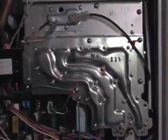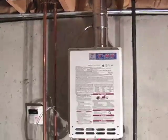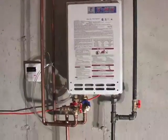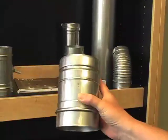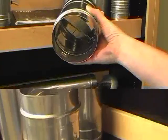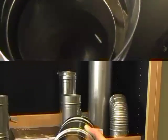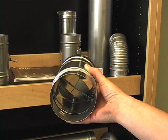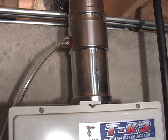This will prevent any carbon monoxide leakage. Because of the cost of stainless steel, it is recommended that you mount the heater in a position that will limit the vent run length. You could always run your copper and your gas line to the water heater at a much more affordable rate. When installing a tankless water heater in cold weather climates, it is highly recommended to utilize a backflow damper as well as a vertical condensate drain. This will make sure that you do not have any cold air rushing into the heater from the outside. Also, you will expel all your condensation properly and away from the heater. Many venting manufacturers, such as this one shown, produce a combination unit that will provide for both.